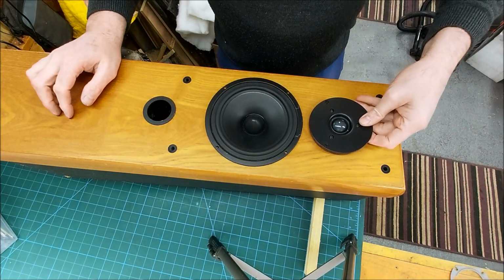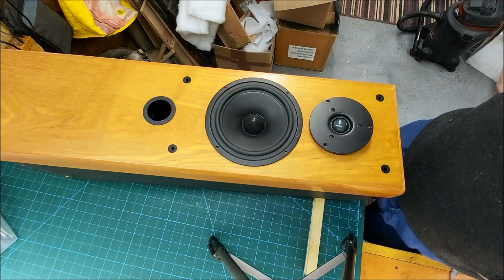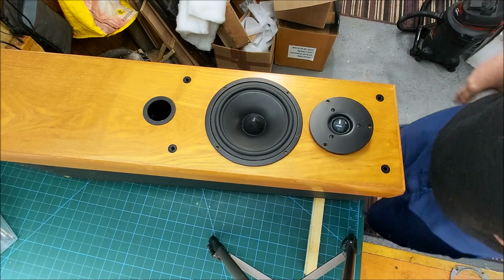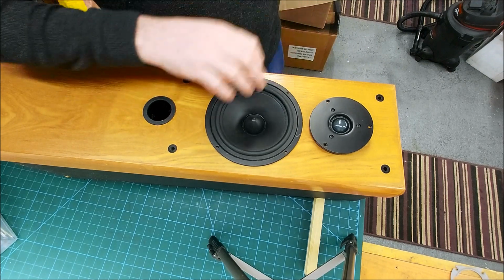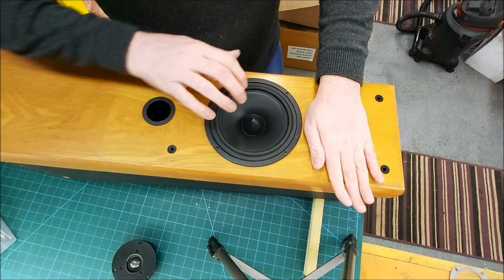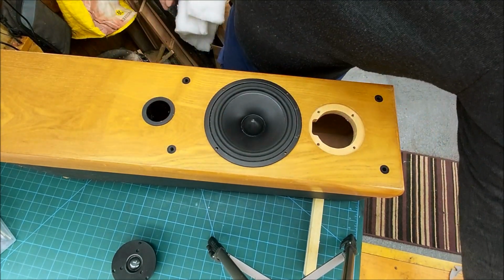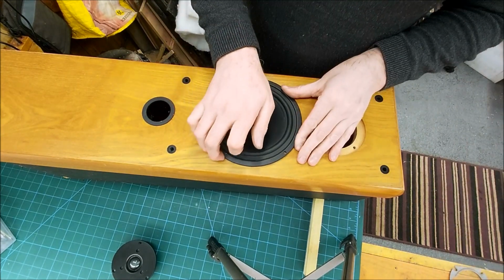With these tweeters, that might work quite nicely, really. I could just open up the cutouts, but then I'm revoicing them, building a new crossover for them. They're not a Ruark Talisman anymore. They're a new speaker. So yeah, interesting really. Probably have to retune the port as well. This is not going to perform the same as the original. But there we go.